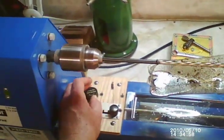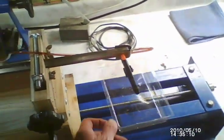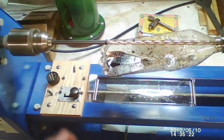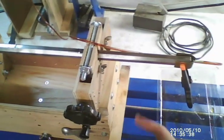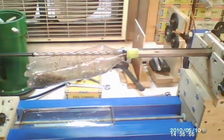I'm going to set the speed down a little bit. I'm going to remove my stop block and place it at the end — when the cutting starts I will set the stop block so I'll know where the cutting actually started. So now we engage. You might be able to see the lead screw slowly turning and slowly advancing the carriage. When we hear the cutting begin, we'll set the stop block back here so I know how far the travel has occurred. Now the boring operation has begun.